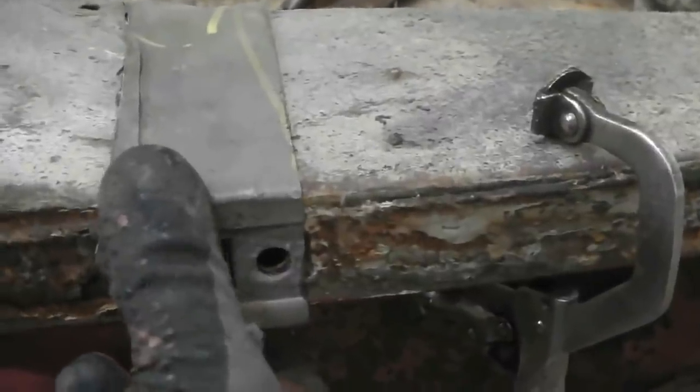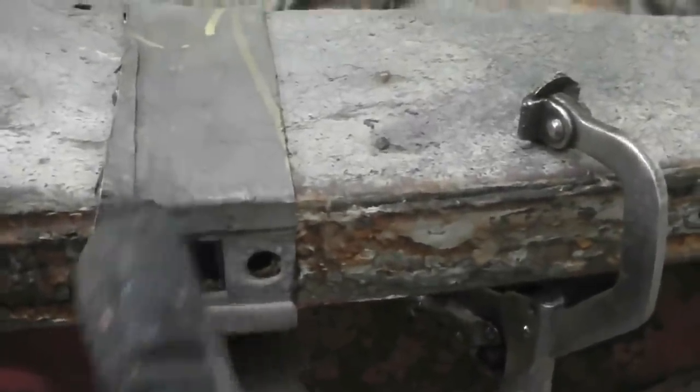Across there to allow for that on the line, and we'll strike the line with a marker, then clamp that in position, and we've got a good reference point. That one of those holes for the earthing wire there, that dished hole, that's the earthing wire hole for the headlamps at the front. If we shift it across to the right and then make our cut, then offer it up and see what we've got.